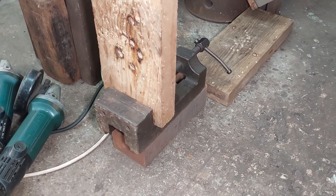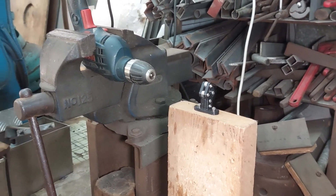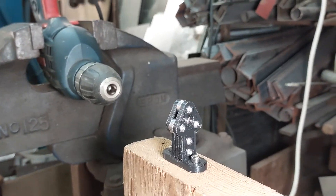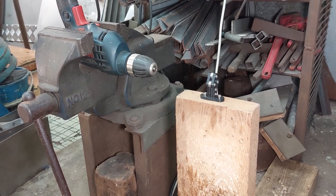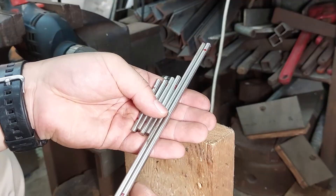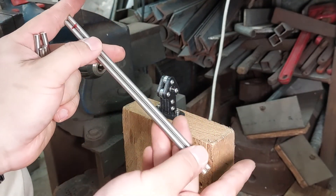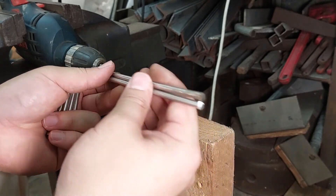It's not an ideal setup but it's a work in progress — it worked pretty well, I made four links in about two hours last week. Here I have everything measured out and cut to length. The short ones are easy, but the long ones really need that extra support — these are 18.5cm total length. Without support at the very end they'll be wobbling all over the place and it'll actually be dangerous.